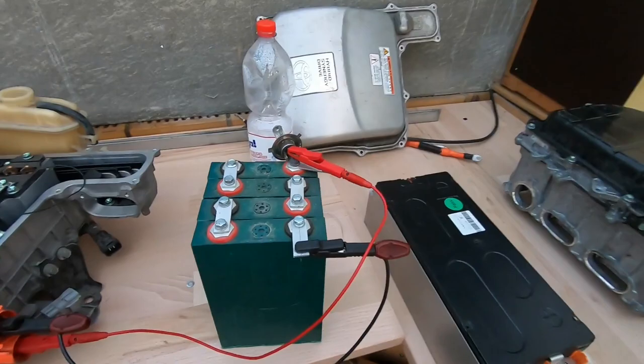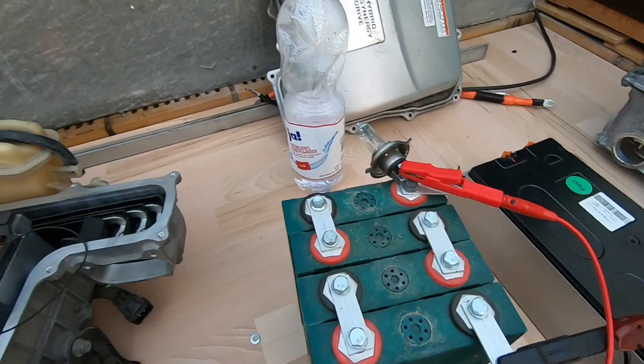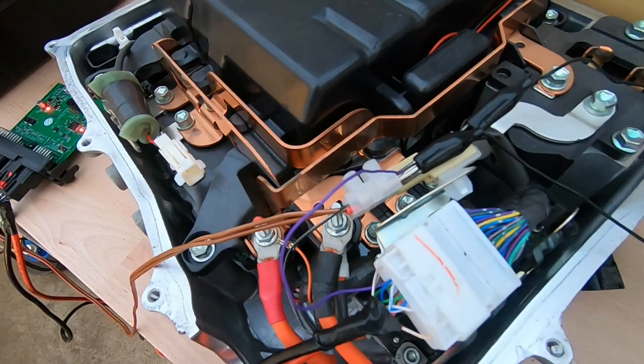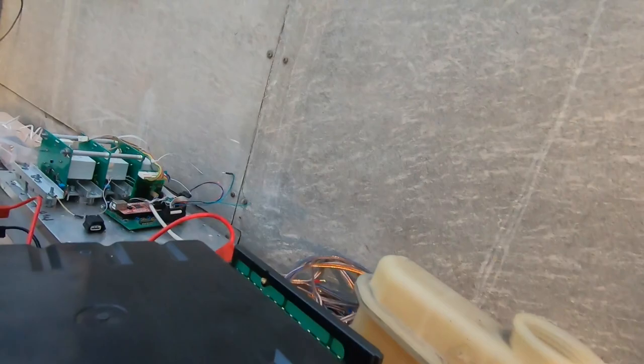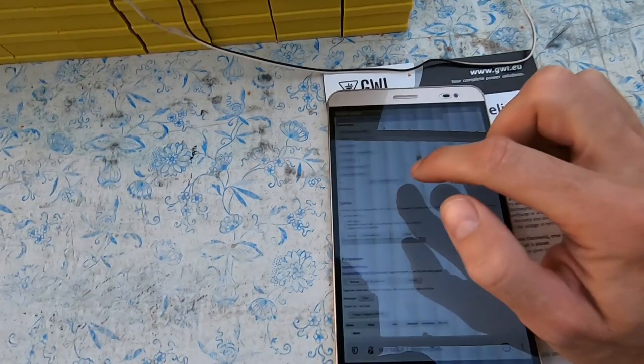Here's where we're at. I have connected an extra 12-volt battery to the DC input and I've used the Damien method of a load resistor to not short anything out. Right now the shutdown input is connected to 12 volts, and as soon as I pull it — bam — DC input is shorted. Now let's put it back and start the charge mode.